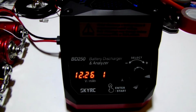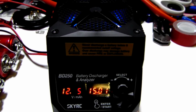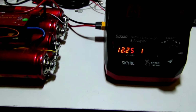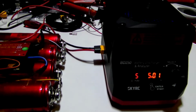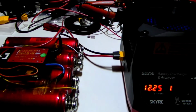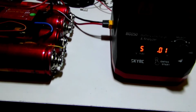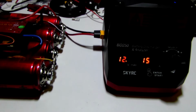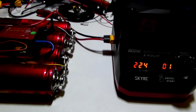Got 2 cooling fans on it, a thermal switch, and 2 heat sinks. It came with just the board and a real thin aluminum cover. So they're built to where the components can handle the power, but they can't dissipate heat, so that's what usually kills them. So I added some heat sinks and some fans, and it's been really good for close to a year.